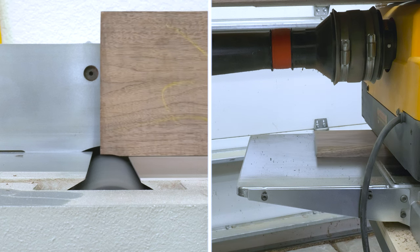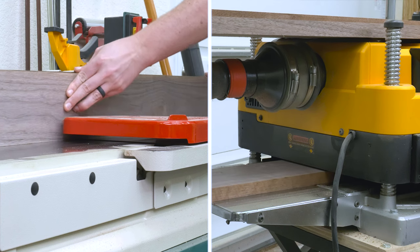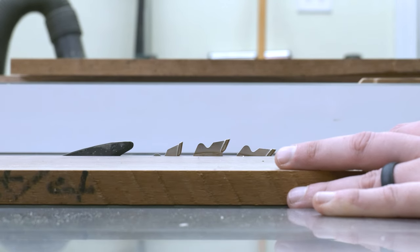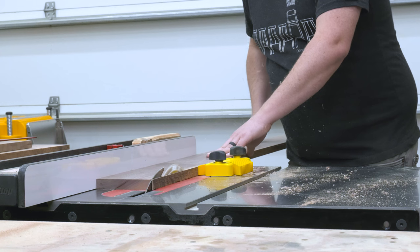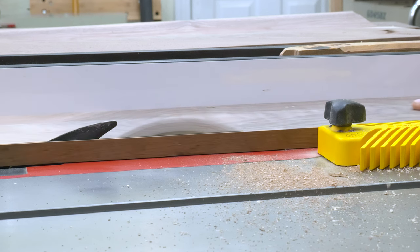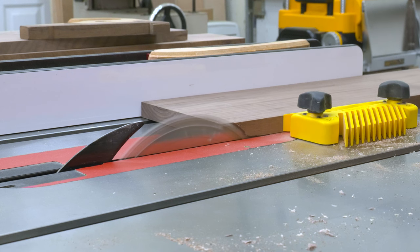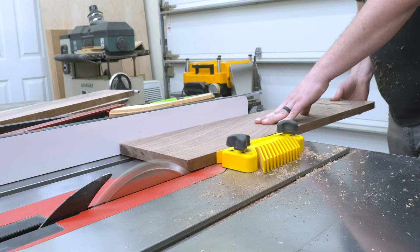Milling the lumber is where I feel like I really get to know the wood and I get to see that grain pattern pop out. The boards start showing me where I should place them in the project. These boards didn't have the grain pattern I was really looking for, but given the current state of things it was what I could get. So I tried to take advantage of the nicest boards and orient them to the front of the piece, only trimming off as much material as was necessary.